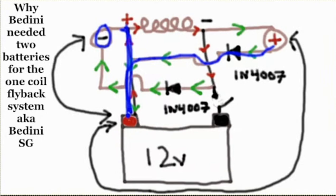There is a different way of doing it, the way I got around that without shorting it out. That's all I wanted to say. When you take the flyback, you dump it into a full wave bridge rectifier. The DC coming off the rectifier, you put into a capacitor. So now you've changed the symmetry because it's gone through a capacitor. Yeah, but he also says do it as fast as possible without a capacitor. No, but the reason for it is you can still do it.